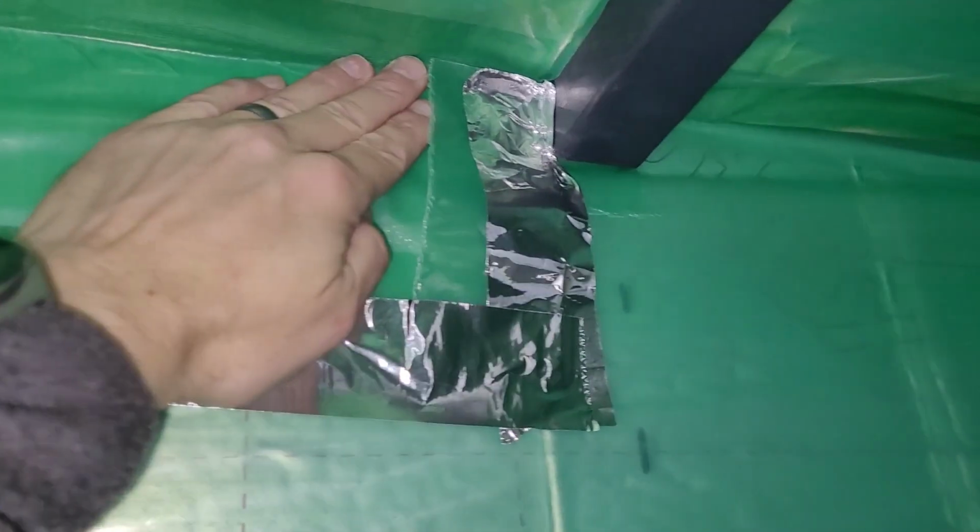So it's going to go lengthways as it is there, raise it off the floor by 10mm or so, just in case any water on the floor, then that doesn't start to soak up the wooden wall as such. So raise it about 10mm off the floor, and then obviously all fixed to the timber upright, and then the second one will then go above it, and it will go all the way up to the ceiling, and it's going to get cut round these 6x2s.